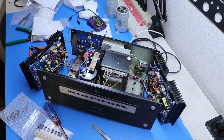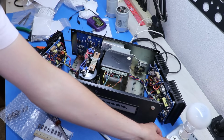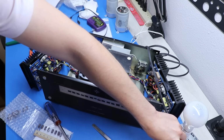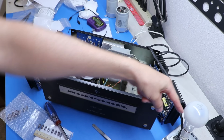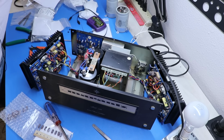So now it's time to get this on the dim bulb. So here's what we're gonna do. We're gonna plug our amp into the dim bulb, and this is technically a 3-way lamp, but I think it's 100 watt normal, because it says 50, 100, 150. Somebody can talk about that in the comments.